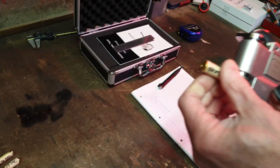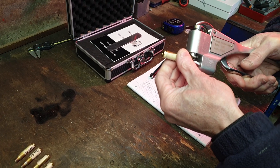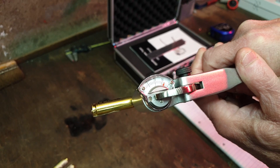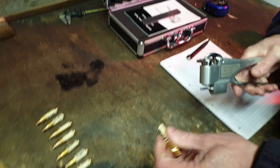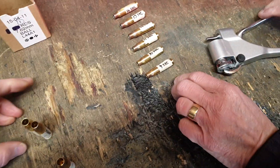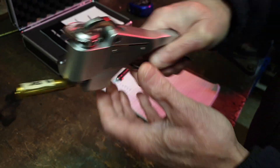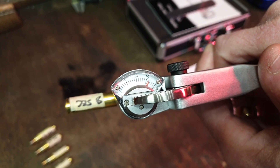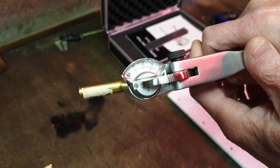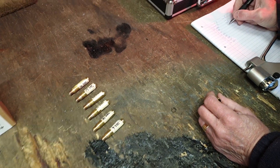Sixteen, lo and behold. This is all off the cuff, viewers, this is in real time. Sixteen and a half. Okay, so let's try his eight-second anneal. So that's annealed for eight seconds. Sixteen. Well, that's not annealed then, is it? Nope. So eight seconds isn't long enough. Sixteen again on the button.